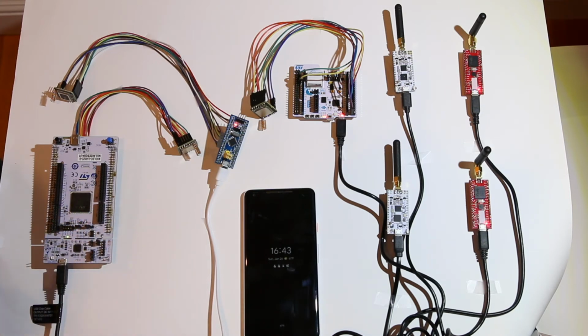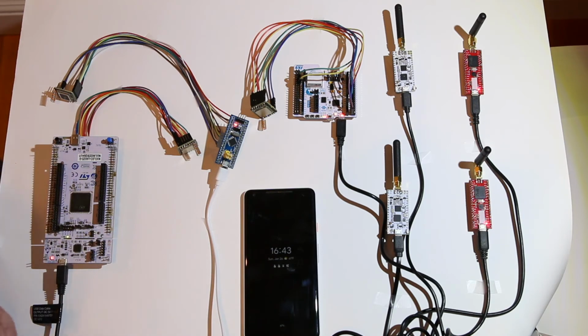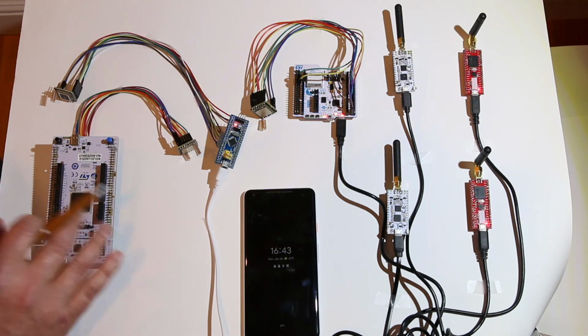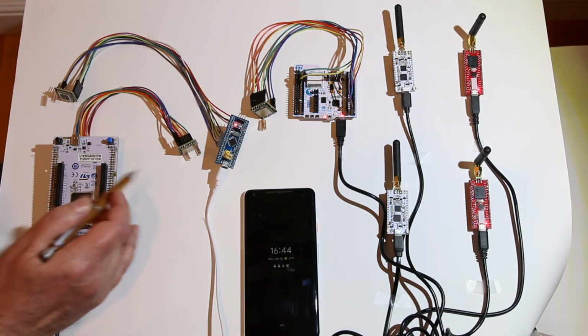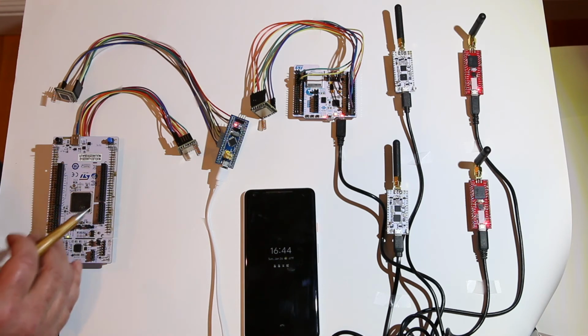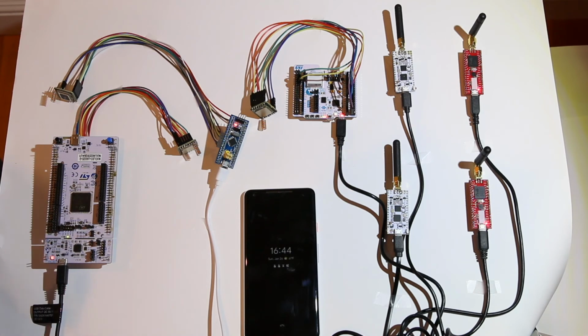So this is an interesting solution. It has a security aspect to it, where you have a highly protected asset, the radio, and a non-secure application, which could screw up and will not take the chip down, because the secure radio part is protected. You couldn't make this be a different node, because the node ID is over on the secure side. So the non-secure radio code cannot suddenly make itself be a different node in the network. There are some interesting applications, I think, for this type of technology. The secure boot is done in Ada, which then passes control over to the non-secure side.